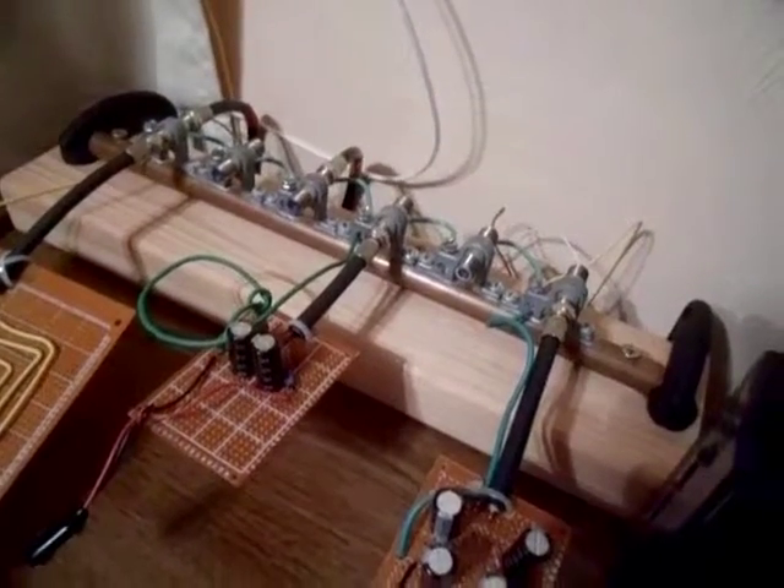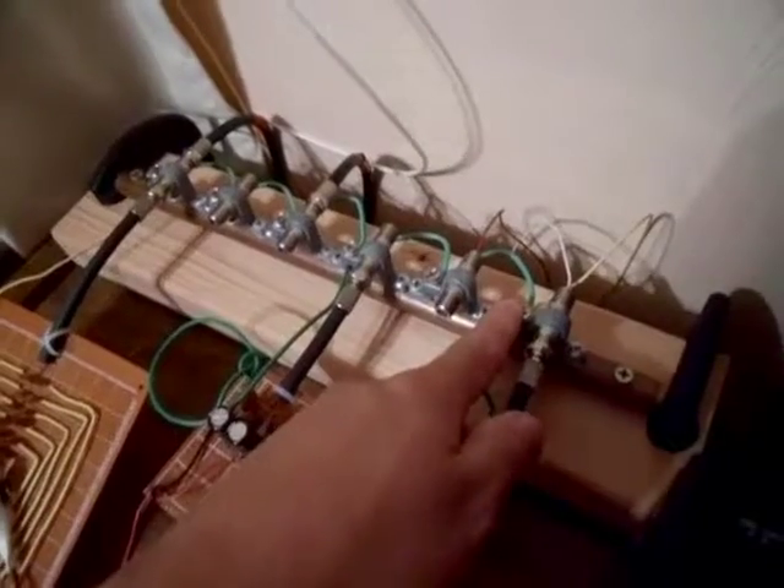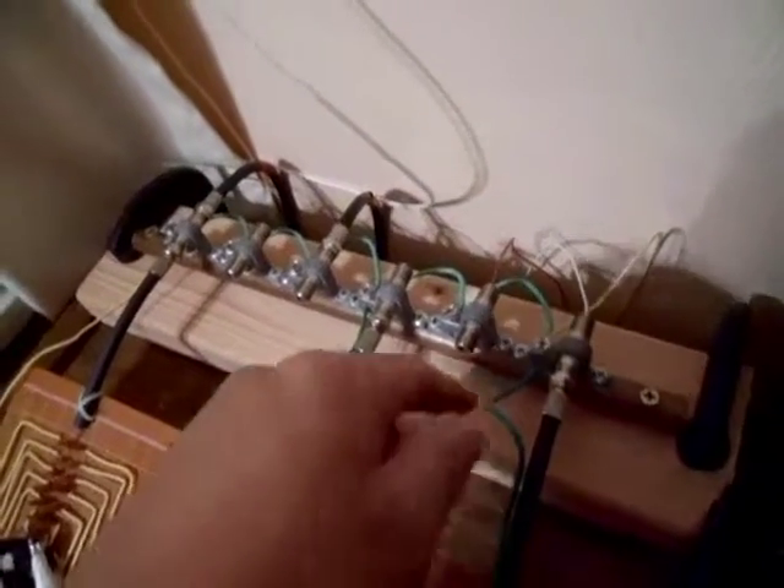Hello. I am so glad I did not get rid of this grounding bar that I made four years ago. It's just a bunch of standard coax grounding blocks on a piece of copper pipe. The copper pipe is mounted on a board, and I have each grounding block bonded with some copper wire. And I just clamped it to my desk with some C-clamps.